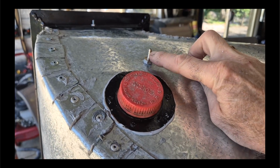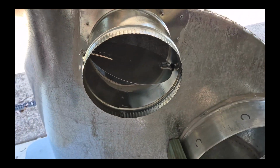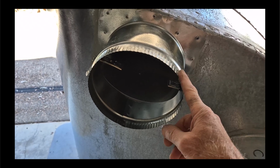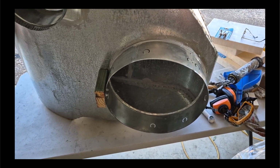And this is a little spigot to put on a tube for the air pressure meter. And I've added this ductwork for the 200 mil ducting to go into the lounge at the bottom of the stairs. That's something I've added myself. But for all the other vents, they're supplied by this 400 millimeter diameter duct here.